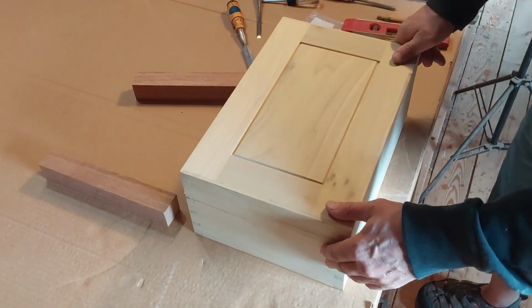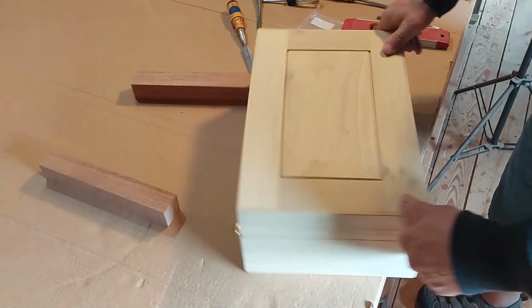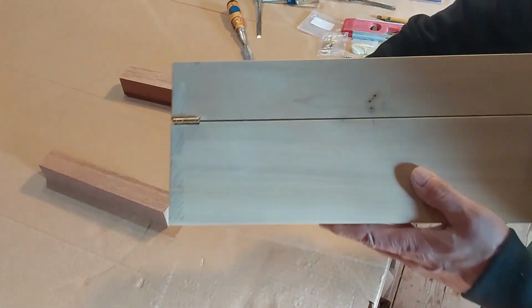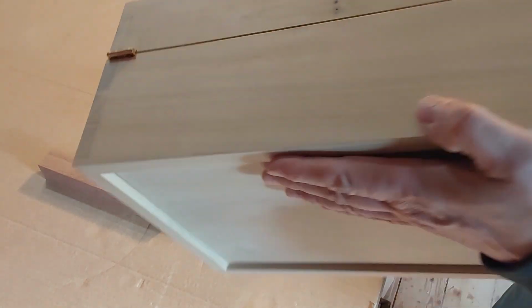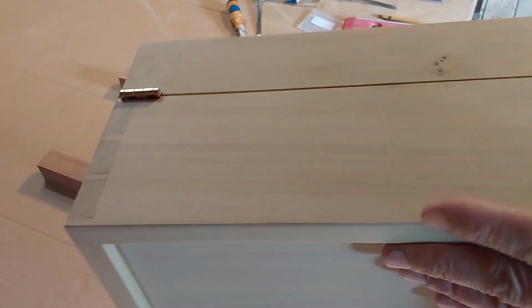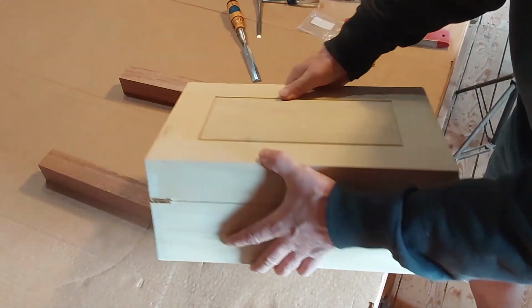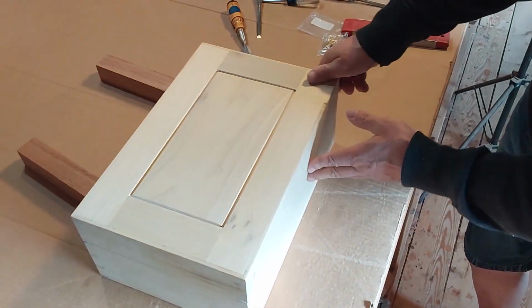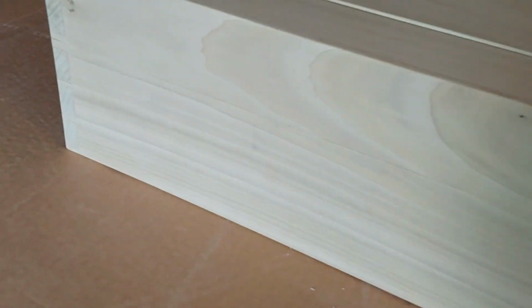That looks good. It's got just a 64th and a little bit of a racking. I think when I put in the other screws, that'll pull into alignment. But what's important, even though there's a little bit of a space there, is that this aligns. It's hard to see. So that this is flush. I need to put in the extra screws to pull it down tight, and maybe just shave a little bit. But you can see, I'm going to pull it out and show the front edge, that the alignment of the two pieces with the flaps looks really good.